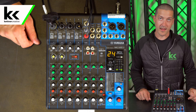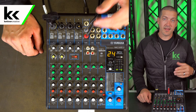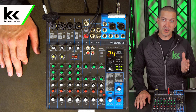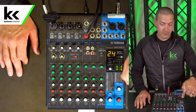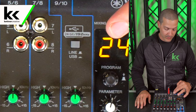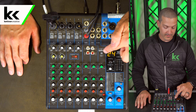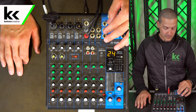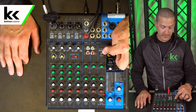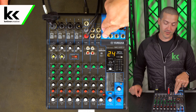Next I want to talk about channels 9 and 10. If you're using the USB cable out the back of the console for an audio input — say you're on a live stream watching content and you want it to come in — you don't want it to come into the console, go out the main output, back to your laptop, back into the console, and back out again, because you'd essentially create a feedback loop. What this button does is allow the USB to come in through channels 9 and 10. If you click it off you won't get anything coming out of the USB, but if you click it on it'll mute the two stereo inputs and you'll just get the USB. There's also another button to push down that will send the audio through local monitors plugged into the monitor output on this console.